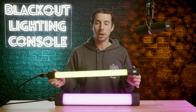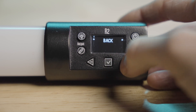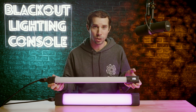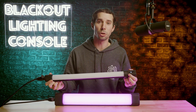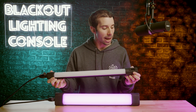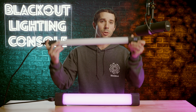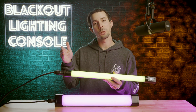The LED screen is a nice way to make quick adjustments to the tube, although with menus where you see one option at a time you can get lost in the submenu of a submenu. Quasar does include a nice blackout function right on the tube so you can adjust settings without it blinding you. They also have the option to turn the status and screen lights off so that if a camera were looking at the unit, it wouldn't see the lights. Note that you can't actually blackout the unit if it's receiving DMX, which is actually a good thing — so you don't have technicians rigging this in the grid with a button off and having to go up and physically turn it on like the new KinoFlows, which is highly annoying.